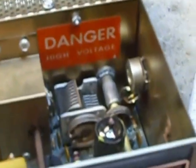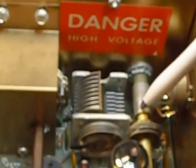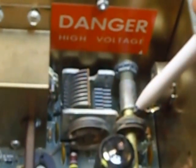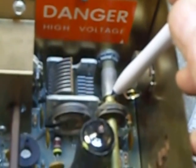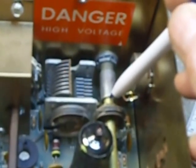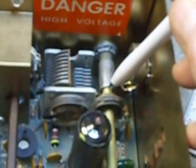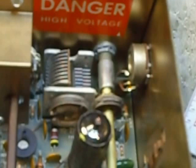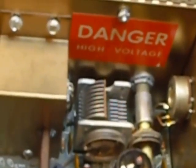These shafts here — you can see the knobs are concentric. Right here, this shaft goes into that coupling and just butts up against it; it would grab both shafts and they would turn together. The only way you could tune it was with both hands, and it was difficult because it really stuck. So I pulled that apart and put a very thin washer in there — I believe it's a three-sixteenths diameter inside hole, very thin — and it tunes very nicely now. I put a little drip of oil on it too.